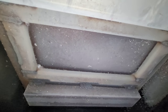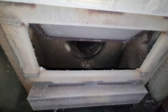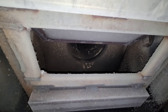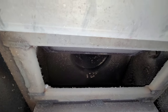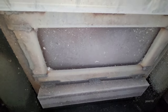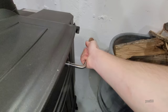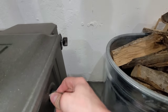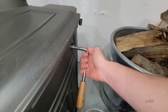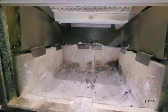This is called the bypass in the back — not actually a damper, it's called the bypass. There's a lever on the side where I open that up while we're starting the fire, and now you can see up the flue pipe. Immediately when I did that it started sucking in air already. On really cold nights, when this thing's not on, you can feel little drafts coming out of it, but it's really not that bad.